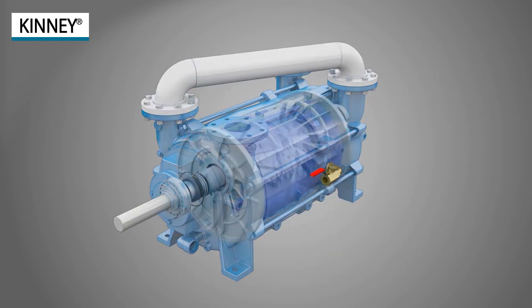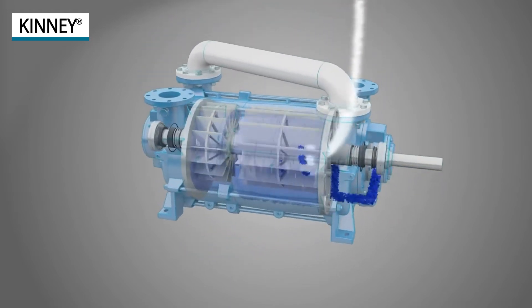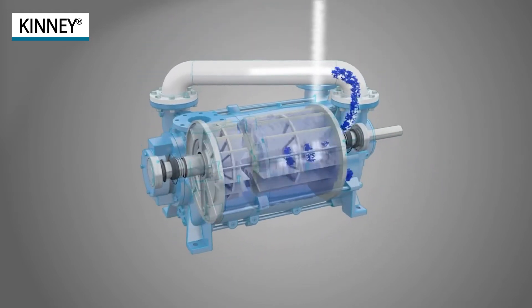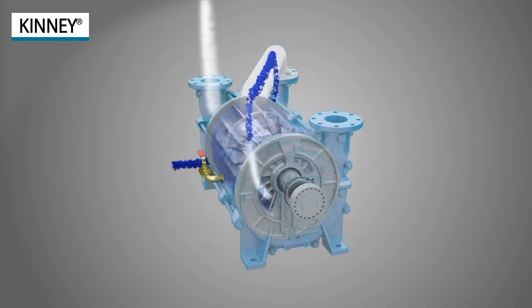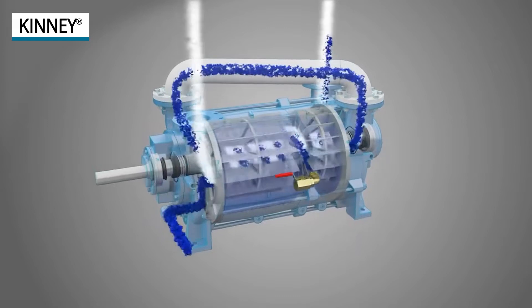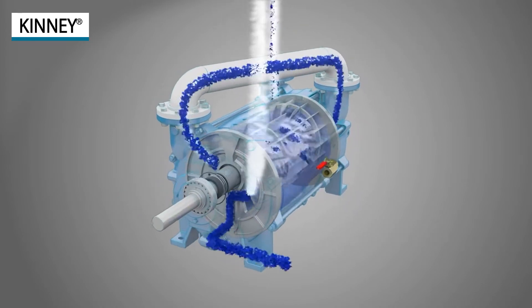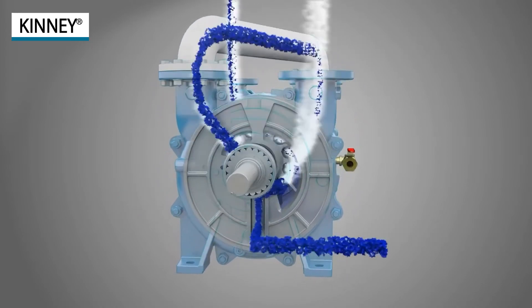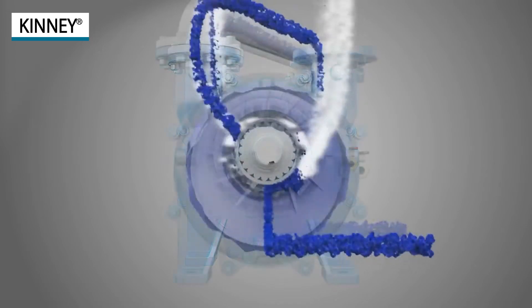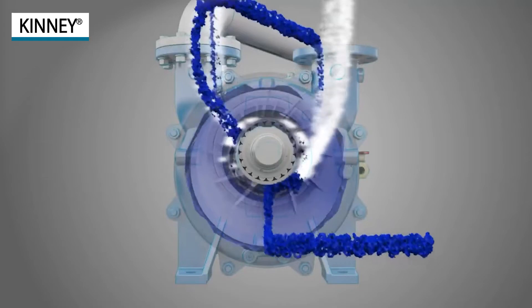The KLRC is a non-pulsating vacuum pump designed to remove gases through the use of its rotating impeller blades that enter and leave a ring of liquid. The impeller forces this sealing liquid to the periphery of the pump casing where it forms a ring of liquid around a center void. The impeller shaft is mounted above the centerline of the casing, while the blades, although rotating concentrically, are located eccentrically with respect to the casing and to the ring of liquid.